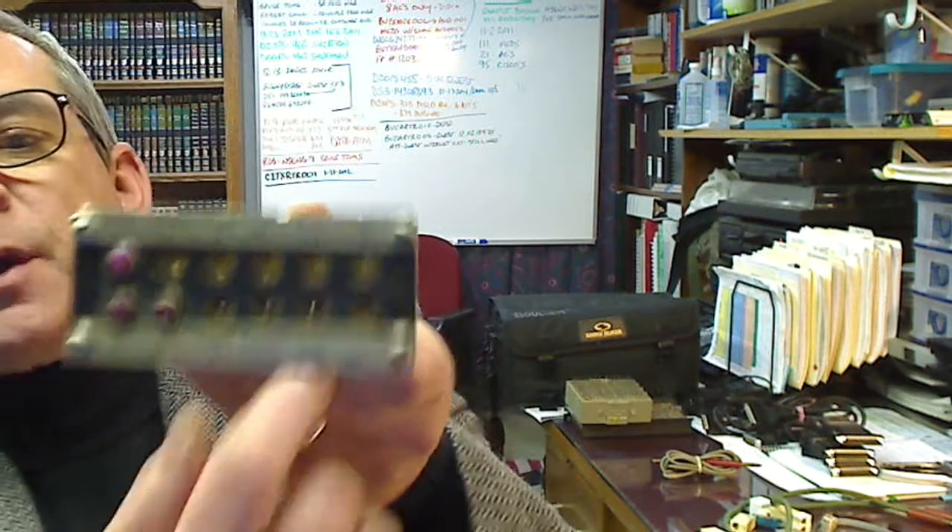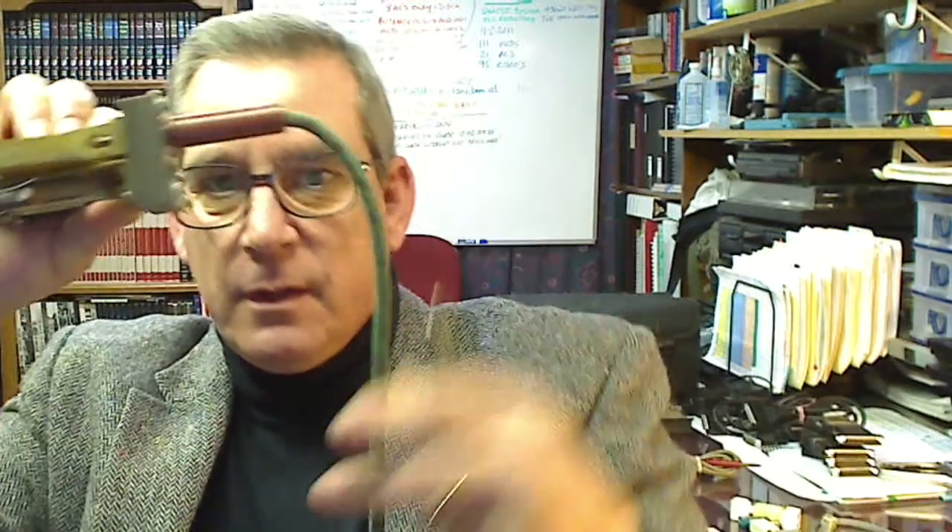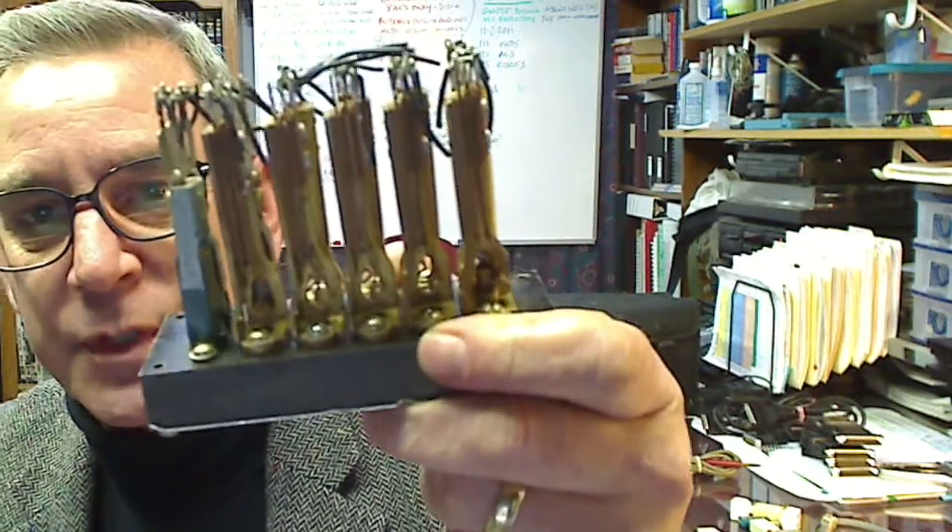Krone was a takeoff of what we used in the central office. Back in the early central office days, we had massive patch panel bays with thousands and thousands of connectors where you would actually patch a line cord. Here's an old tip and sleeve — not even tip, ring, and sleeve. It was a material-coated paper tip and sleeve, and you'd actually patch into the circuits. You had hard wire on top and cross-connect on the bottom, or vice versa if somebody installed it wrong. This is an early patch with soldered connectors — back in the day, everything was soldered.